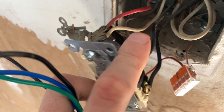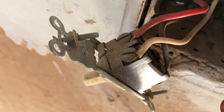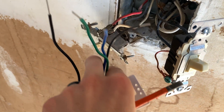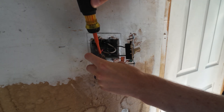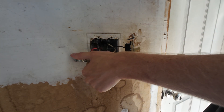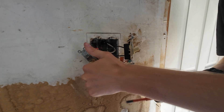Now I'm going to take off my red and my white — keep track of them, because remember those are our travelers and the black is what's going to the light. Now we're undoing the left side — this is the three-way switch. Three-way: the pair of travelers go to a pair of screws. In this case it's our red and our white, which is a little different — usually it's black and red — but just take note and we'll be good.